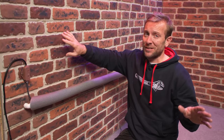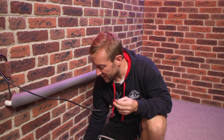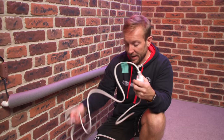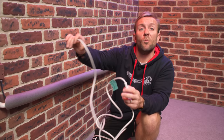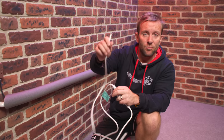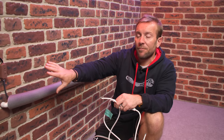These are very, very simple to wire up - they are effectively a plug. If you don't know how to wire a plug up, I'm not going to show you how to wire this up. It's a twin-and-earth cable - we've got our live, neutral and earth. We use the small connecting block supplied to join that to our little MCB. One wire joins to our trace heating, and the other wire goes to our power supply. There are two ways of powering these: you could wire this up to the permanent live out of the boiler housing itself, or if you don't want to run wire across the kitchen worktop, you can just wire this into a plug and plug it into the wall. It will then run completely on its own.